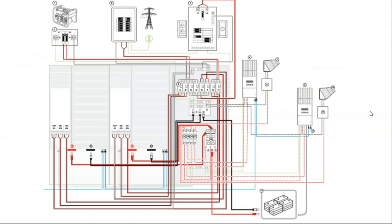So you could say, okay, I don't have the money right now for two inverters, so I'm going to use a grid tied inverter and only have a little bit of backup power during a power outage. And that's fine. But then if you start to eliminate things like switch gears, then you lose this ability to actually wire the batteries in an AC coupled manner.